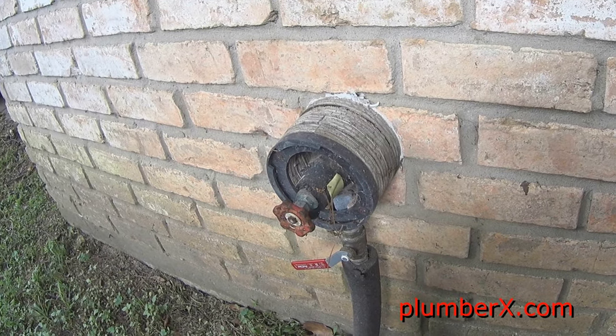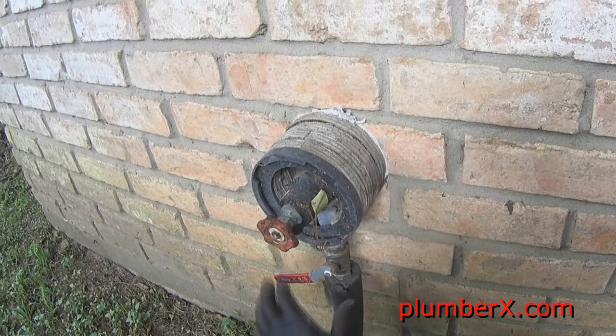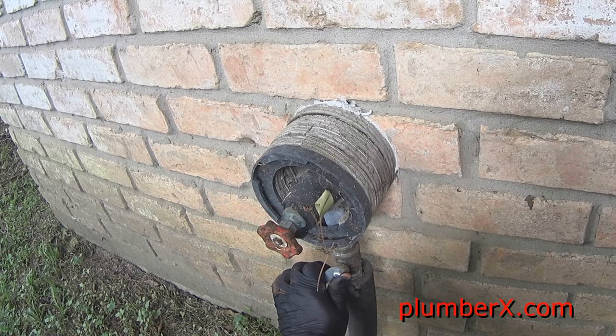And what I've done before I even did this is I went to, there was another tub in this house at the farther end. So what I did is open the water at that tub so that the pressure coming into the house would go straight through the system and out through the further side of the house, clearing all the lines so that you won't have any stoppages on any of the other sinks when the calcium and stuff comes through and starts to clog up your aerators. And that's not blood, that's just a little rust from pulling the stems out.